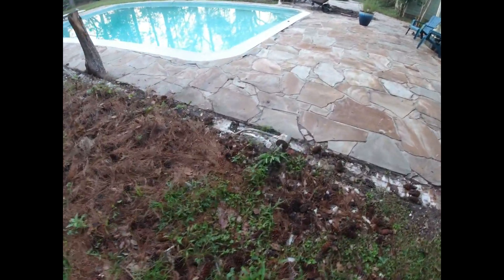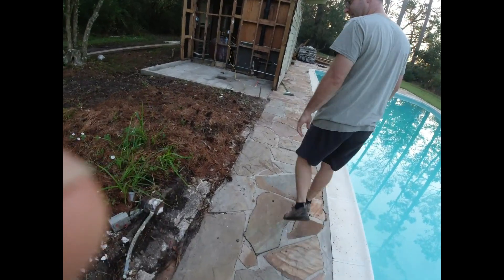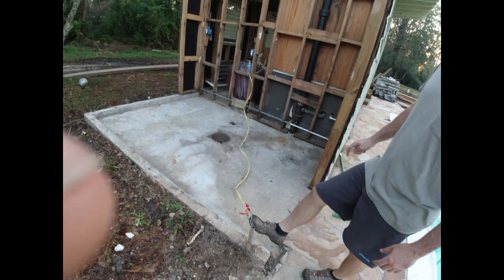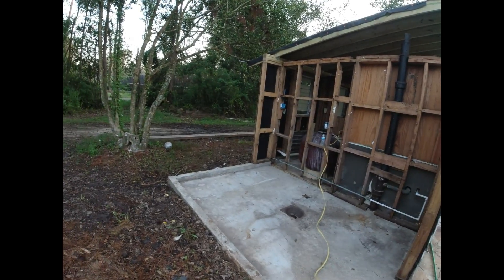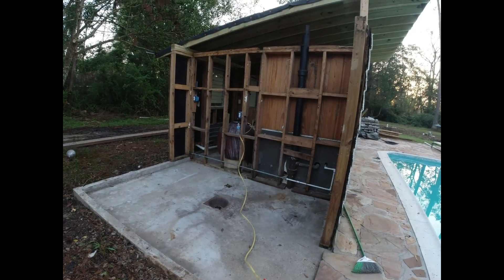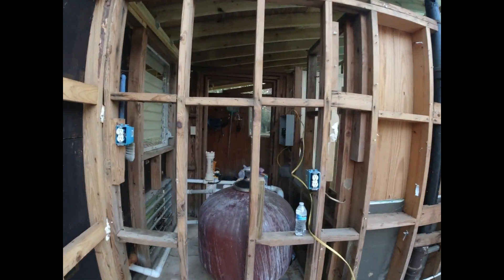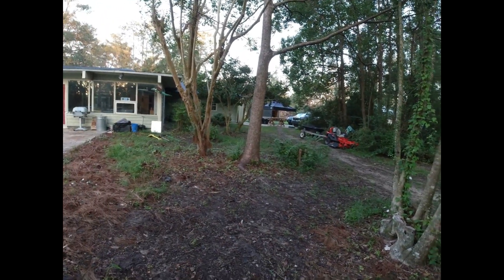But you have power — it's right here. This is trash power. What do you mean trash power? Tiny little wire, and it's shared with bedrooms and other random stuff inside the house, not on its own circuit. So we're putting in a dedicated circuit for the pool house and the future shop. It's going to be a 100 amp breaker, and we have wire accordingly, so we need to bore. The biggest challenge will be to bore a hole under the driveway, which I've never done.